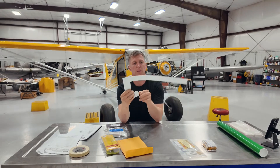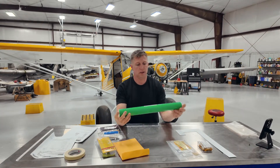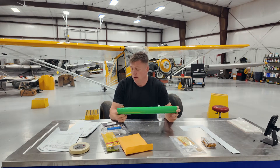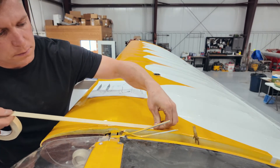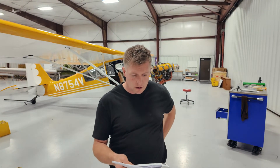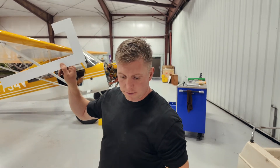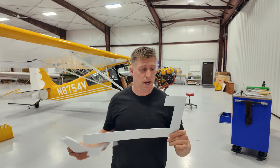The layout tool — I believe you just put it on the wing and it marks where to lay the tape, setting the distance back for the start of the VGs or the template. What it says is to place it on the bottom edge of the wing, then take a pencil and mark it on the tape. That sets the line. Then measure an additional one inch aft of that pencil mark and make another pencil mark — that will be the template reference line. Then stretch masking tape span-width between those pencil marks.